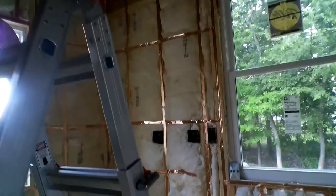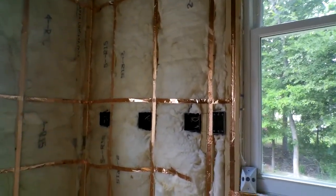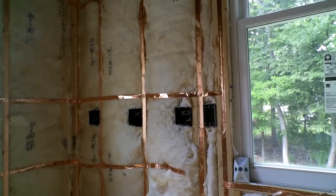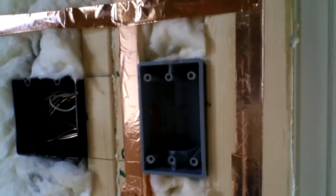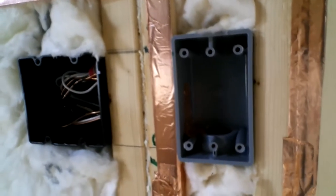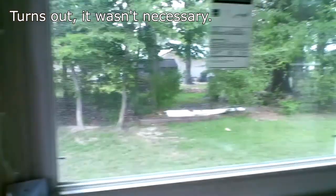And over here is the box where my antenna leads are going to come through, and I'm kind of concerned. I'm up to three now. I may have to have a switch that just uses one coax or something like that to get through there, because that's only about an inch and a half or so ID. It'd be hard to fish a lot of coaxial cables like LMR400 and RG8X and all that, and plus grounds and everything else through that. So I might just have to use the old AB switch, remote switch, which I have and I can use.